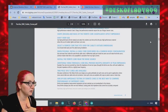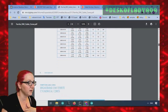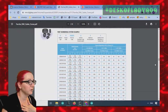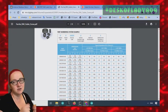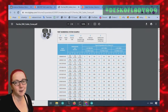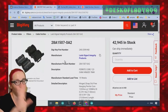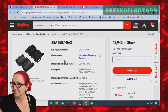It looks like they've got some good ideas — this is kind of a nice datasheet. They give you specs for all the different sizes, including CAD files and dimensional data, so they have everything covered. I think they just bought a couple of different beads, and DigiKey does have bead kits. They clip on until it passes — I remember talking to an engineer who said to pass FCC, you just try different ferrite clamps until basically it passes, and that's the one you ship your product with. So this is my pick, but there are many, many options — a wide variety of hinged ferrite cores. That's a great search.